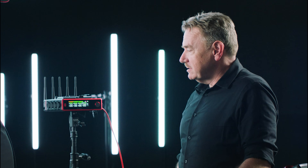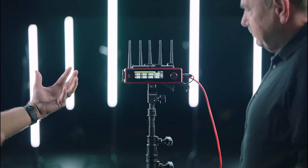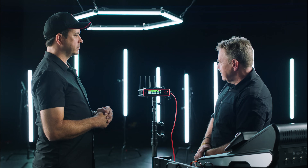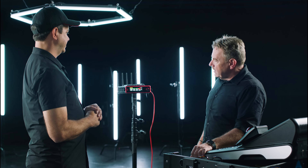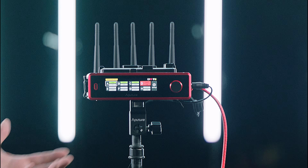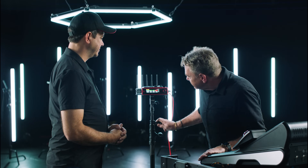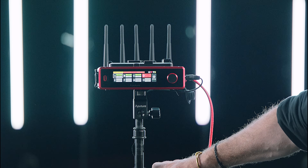It's about as simple as it gets. You can see here universes A through D — they're showing green. Green is good, we got data. So Dave, let's go ahead and unpatch universe four. Yeah, that's pretty clear. Universe four is unpatched, so output D is now red. It's very obvious — a big red box. Universe four is now red. You need to know that you have to go up and troubleshoot it, figure it out.